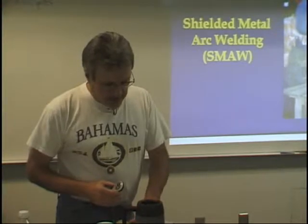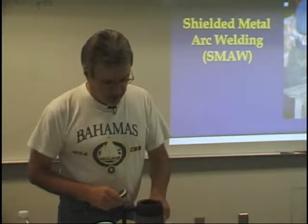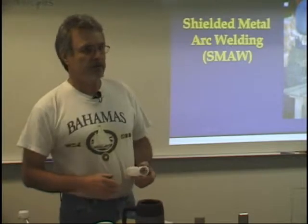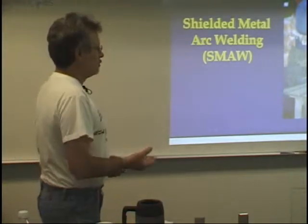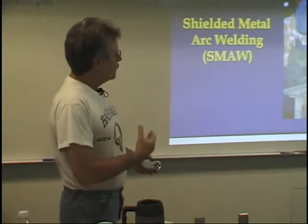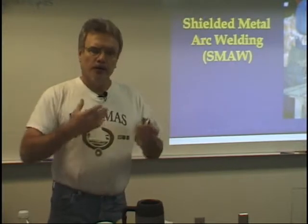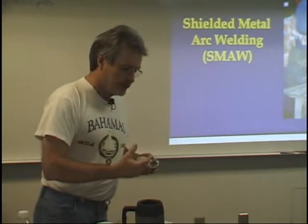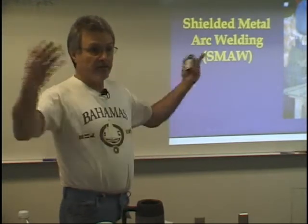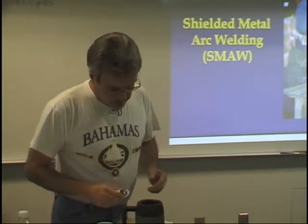The combustion and decomposition of the electrode creates a gaseous shield that protects the electrode tip, the weld puddle, the arc, and the highly heated work from atmospheric contamination. The flux on our welding electrodes actually has five functions, which I'll get into in chapter 12. But for our purposes, all you really need to know is that when you strike the arc, you want to maintain a real short arc so that the gaseous shield has an opportunity to envelop everything and protect it from the air. If air gets to it, you're going to have porosity and other problems. So that's what you need to take away from that.